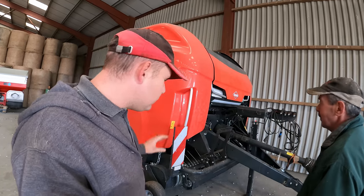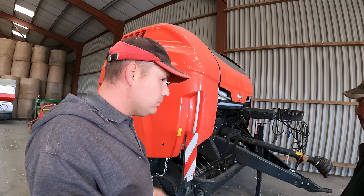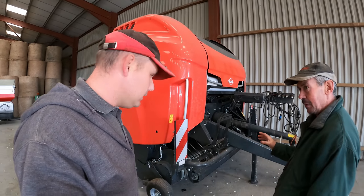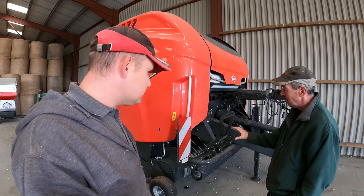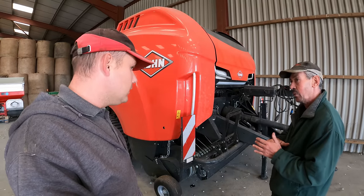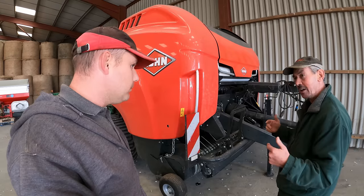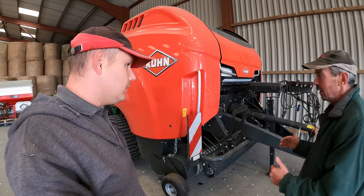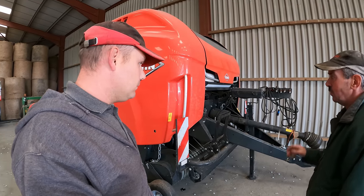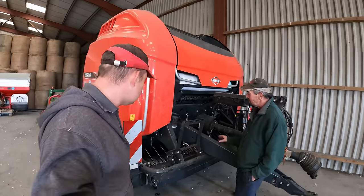At the start we did have a couple of bung-ups. Was that our fault or the machine's fault - was it just tough grass? That was when we went to Bicester into that rough work. That goes back to what I was saying about the pickup - if it's on rough ground and you haven't got it set quite right, it is very sensitive to stopping. Then the pickup starts again and takes a lump in. In Bicester that's what happened, and it was wet grass - we were perhaps pushing our luck a little bit.